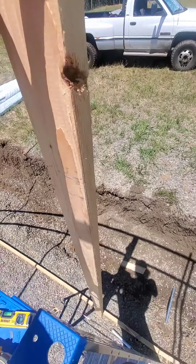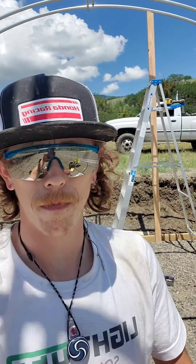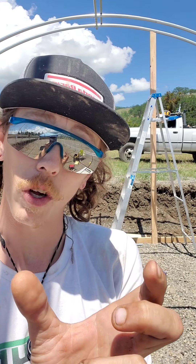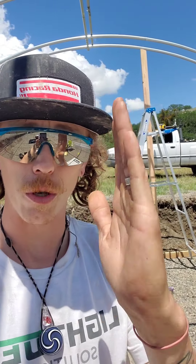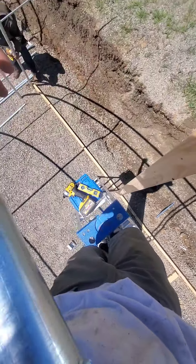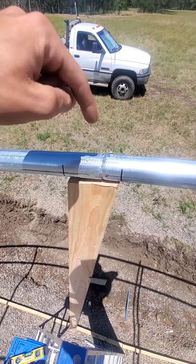We're going to get some end wall framing done. End walls are a whole other story. This is one of our uprights for a fan — there's the other one on the ground. This is a greenhouse-to-greenhouse thing. On the back of your greenhouse, every greenhouse has different size fans. This one is 57 inches wide, so we're doing 57 and a quarter because you have to have some variance to get the fan between the two uprights. I cut my two-by-four to fit, put a torpedo level on it to make sure it's level, and then take a two-and-a-half inch self-tapping tech screw straight down.